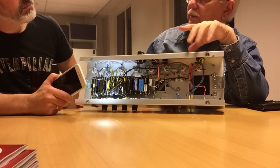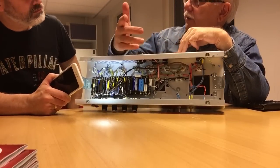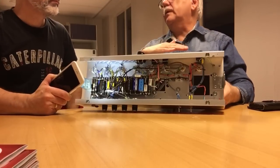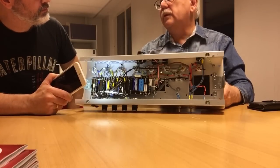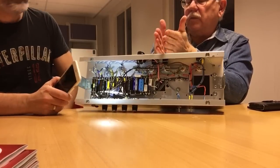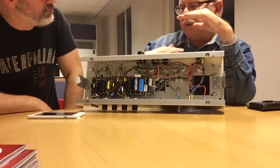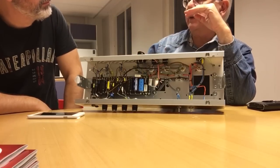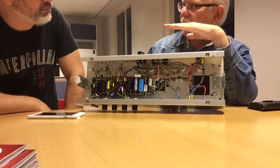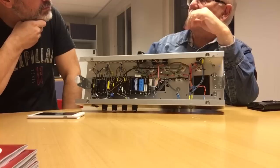And that is idle current. Then, depending on how much current you request from the transformer, by how much output power you want to deliver, the voltage will drop because the transformer reaches the maximum it can deliver. A transformer manufacturer will specify what is called load regulation, which means how much the voltage delivered by the transformer reduces from idle, no load, to full nominal specified load. The normal industry standard is 10%. So from 330 to 300 is normal. This one went from 330 to 310, but under full load at full power, it goes down to 280.